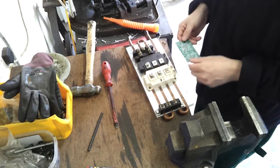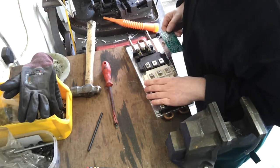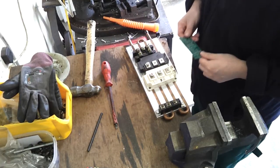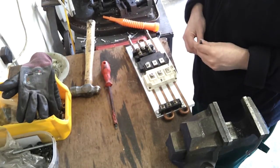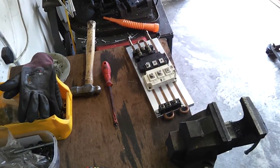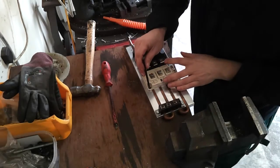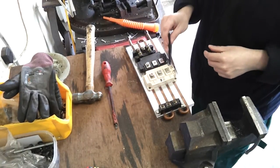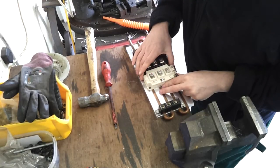We need to build a charger - let's just cut to the chase. There are some out there that are a lot more configurable; the one that springs to mind is the EVTV variant of the TC charger with the CAN bus controller - quite a nice piece of kit - but it tends to be a little bit low on power for what I want, even in the six kilowatt variant, and a little bit on the expensive side. If you're looking for a charger to get moving on, you could do a hell of a lot worse.